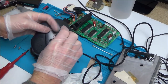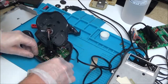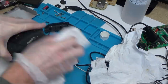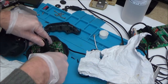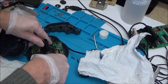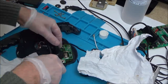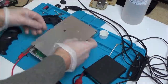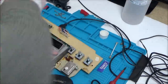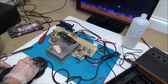Let me have a quick look at the joystick while I'm here. It's very dirty. When you move it down it moves a spring which moves a little contact. With the multimeter on continuity, going between the middle contact and one of the pads and pressing down - it's definitely making the beeping noise. The joystick isn't back together, but it looks like I've got full movement now - it must have just been a bad contact.